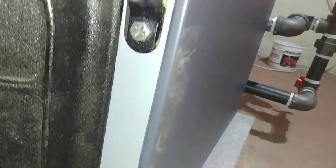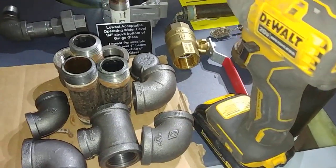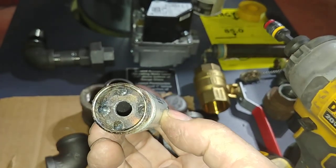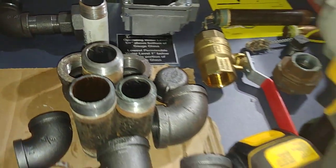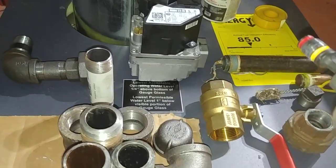There's the schematic — general on blocks. McLean decided not to ship half their stuff, so they didn't ship the hardware and we're a bit behind on mounting the burner. We've got our fittings ready to go in. This is the Carlin orifice — it says 5/16ths. We think that's a little large so we're probably going to get one and drill it out ourselves to about a quarter inch. There's the label we've got to install once we wire this in and know where our switch is, so we don't want to put it where it might be covered by the junction box.